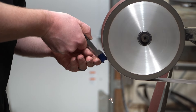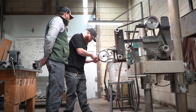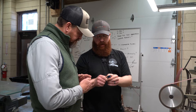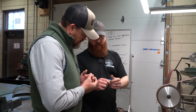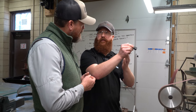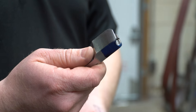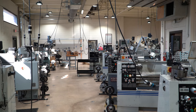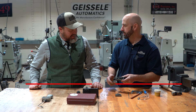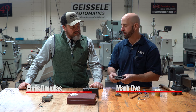The next part is actually going to be about function, not accuracy. We're going to take the bolt and round the backside of it so that it goes over the hammer smoother — it'll make the action feel lighter and smoother. We've got it rounded down, and what that's going to do is make the action feel smoother as it rides over the hammer. And now the bolt's complete.